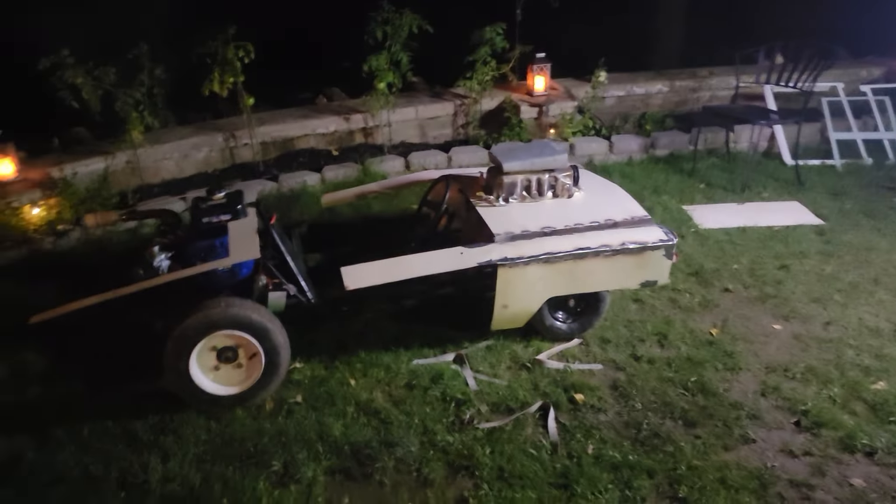We measured the length but didn't really pay attention to the width — our back tires do sit out a little more. We got this piece of conduit, cut it in half, and that's going to help bring the body out a bit and give us a little curved edge to clear the tires. I already did some welding and I'm going to continue.